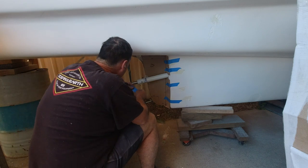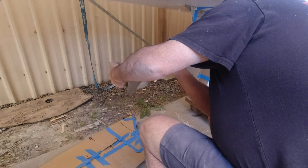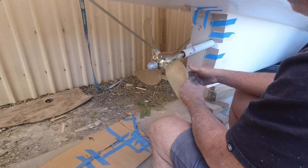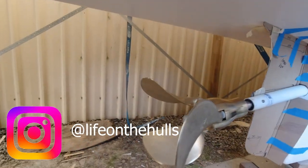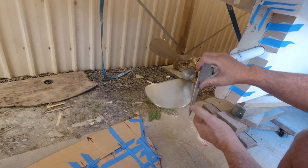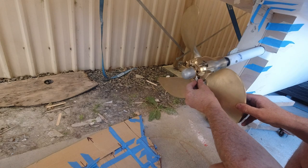Our decision to go with the Brunton three-bladed Varifold propellers took some time, as we originally planned to use the Autoprop version, but the space we had available made for a problem when the Autoprop was in its reverse mode. It was cutting into the fairing. After lengthy emails with Dave Shepherd from Brunton Propellers in the UK, we settled on the 20-inch Varifold version, and in coming episodes I'm going to go deeper into this decision, which has been one of the best decisions we've made. It was matched to the shaft size and also to our transmission, which is so, so important. It's not just a matter of buying a prop and whacking it on the shaft. There was a lot of work that went into the calculations from Brunton Propellers, and I thank Dave so much for his effort.